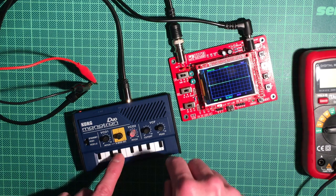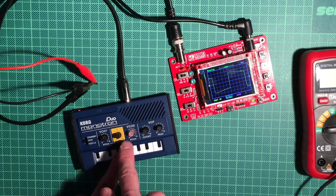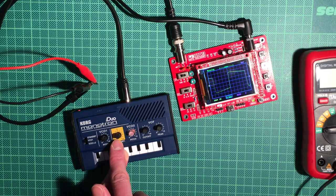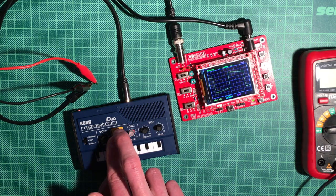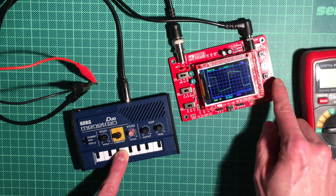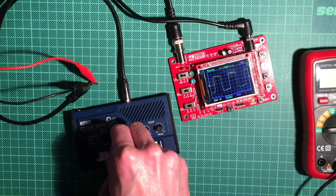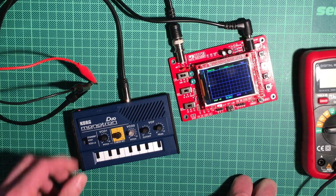that you're doing. One last thing that you can do with a little monotron here is to use the second oscillator to influence the first oscillator and vary its frequency. You see this when I turn up the intensity of the second oscillator, this will start to jiggle. Basically, it will change its frequency. And the higher I turn it up, the more prominent this effect will get. I will zoom out a bit, and you see the waveform pattern jumping around quite a bit. Yeah, so that's that. Quite a nice little tool.